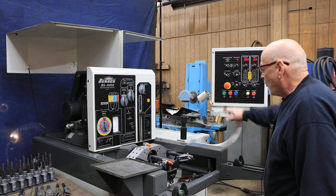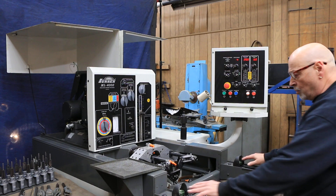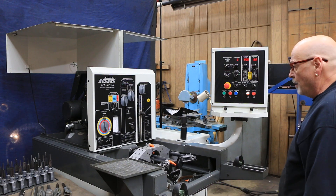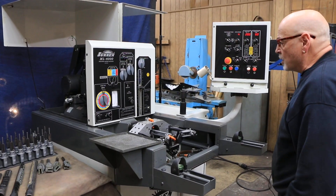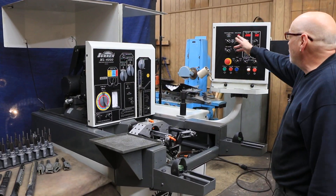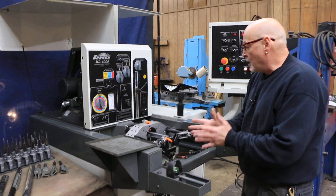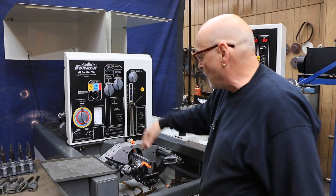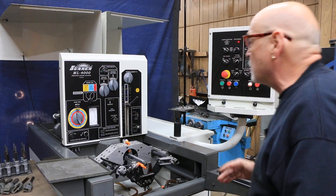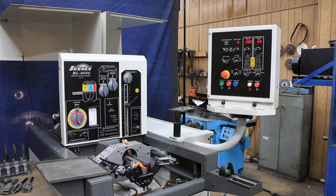The automatic cycle: if you hit that button and stand back, you've got the part held in a fixture somehow, or you're holding it, or you can also do it manually. Basically, it shuts off after it completes its extra strokes — because without an actual sleeve over this, without something for it to grind or hone against, it automatically opens up to the full amount and goes down to zero, and your cycle is over.